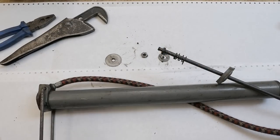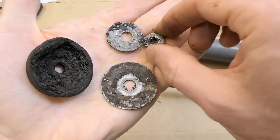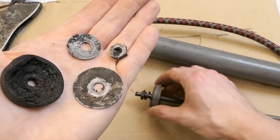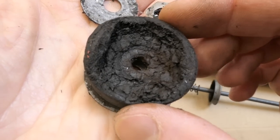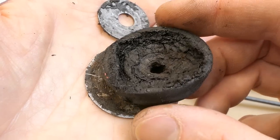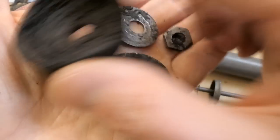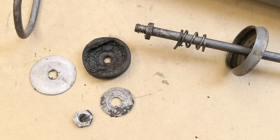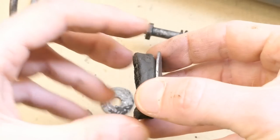This is actually the first time I'm opening one of these pumps and I'm trying to figure it out as I work on it. Here are the pieces that came out. It has to somehow screw onto this rod, and there is a spring which basically prevents it from banging into the cover when pulling it out — it stops more softly when you pull it all the way up. There is some piece of rubber which is very interesting. Is it deteriorated or full of old grease? Probably a combination of both. I'm not sure if I can reuse this or get a replacement. There are two washers — a bigger one and a smaller one — and one nut. I'm really not sure how it's meant to go in, because it was already disintegrated when I opened it. I guess the big washer has to be on top of the rubber, because it's pushing against a lot of pressure and without solid support it would bend up.